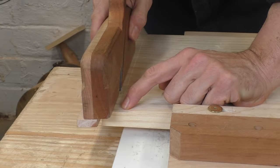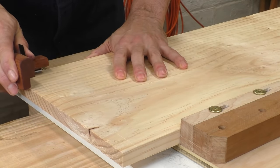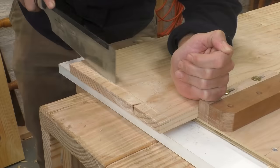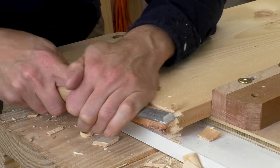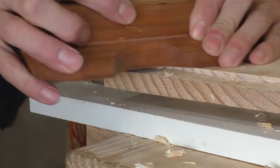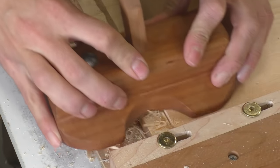Now I'm going to rabbet my front and back boards. I want to use my homemade rabbet plane, but it's too narrow. Luckily, you can cut perfect rabbets without any kind of rabbet plane. My Japanese cutting gauge is perfect for these cross-grain cuts — it marks the line and severs the fibers in one operation. I've also got a standard marking gauge to give me my depth. I'll set up a stop to push against, and then use my widest chisel to make a knife wall, which guides my saw as I cut the shoulder. That cut makes it safe to knock out most of the waste, and I use a bevel-up chisel to peel the wood smoothly away from my line, getting very close to my finish depth. My homemade router plane finishes the joint by making the floor exactly the same all along the rabbet. For this cross-grain work, you want to swivel the plane and get a smooth slicing cut, while giving the left side of the tool firm downward pressure — this keeps the router plane registered against the board and makes the floor perfectly level.